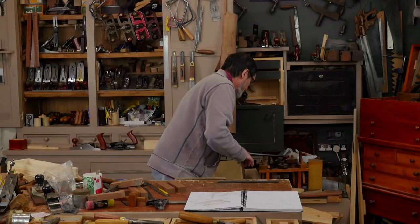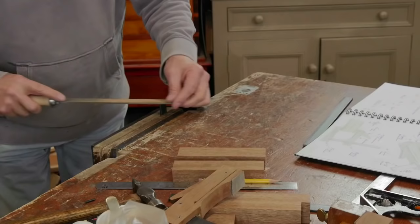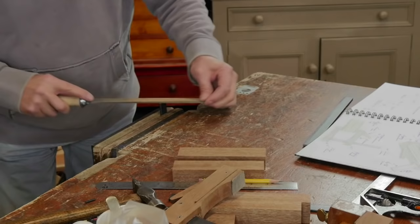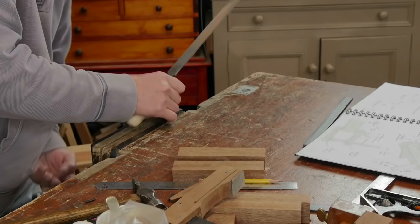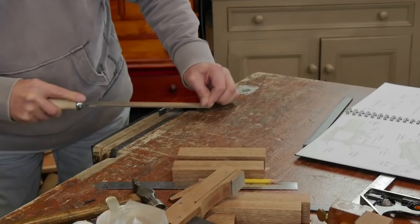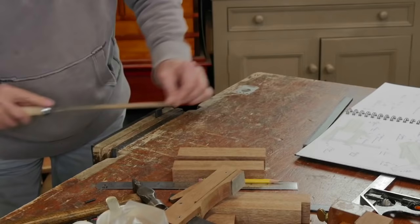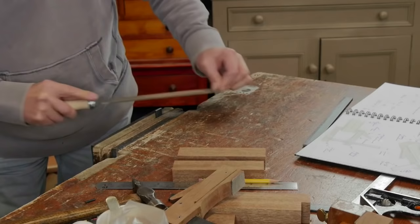Again, it's safety. Drop it in the vise. A 10 to 12 inch flat single cut file will work for this. File. Ooh, that is so bad. Go a little lower, see if we can get that away. There you go. Ooh, that is so hard on our sound, man. Drop it in a little nearer to the surface here. Little better. Filing is a skill, definitely.